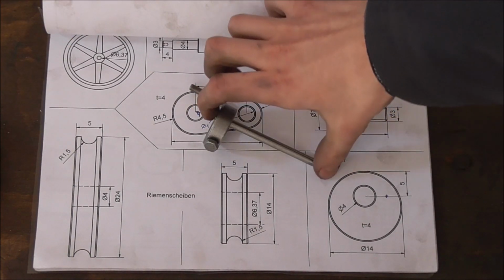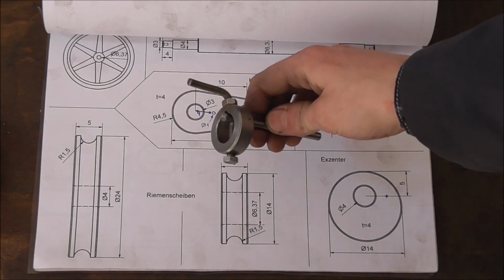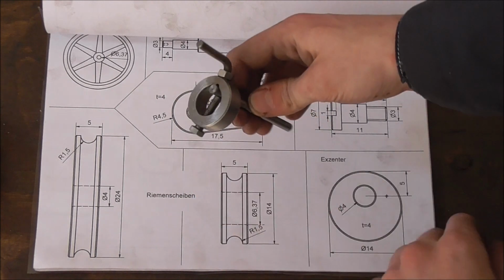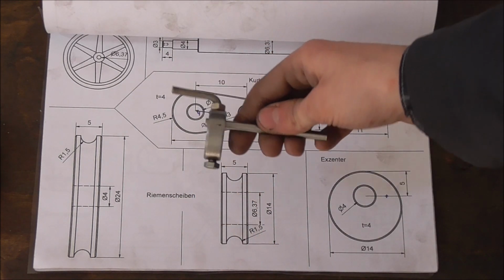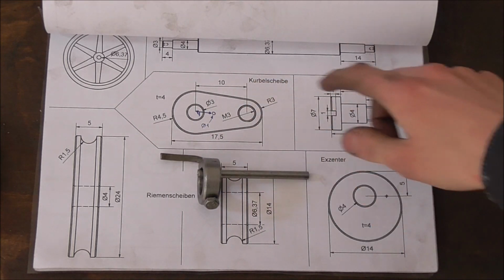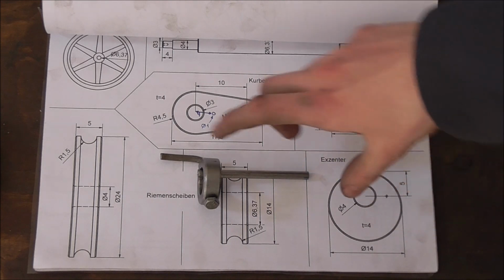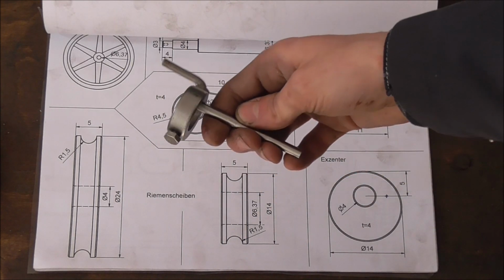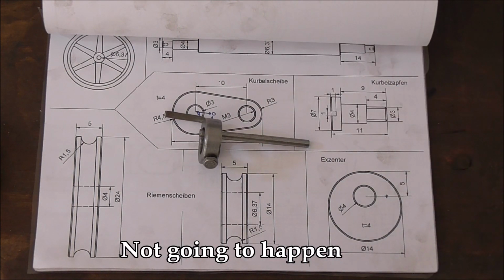We'll machine it from this piece of rod between centers. You see I have the dog mounted already. I prepared this to length and center drilled it a while back, which was insanely stupid in hindsight, because if I wreck the threads on the end, then I have nowhere to start over. But we'll make it count on the first try. I'm pretty sure that's going to work.